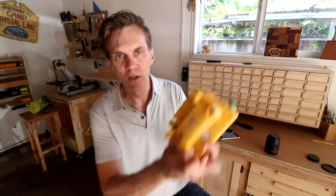I have some more homework for Antonio. Looking at the tools you showed me, here are a few you'll want to consider getting: first, if we want to do a curved cut, you're going to need a jigsaw. I highly recommend getting a random orbit sander. You'll need a couple of clamps because we're most likely not using any fasteners — it's all going to be glued together. I'd suggest bar clamps or F-clamps. You'll also need safety equipment: I use an N99 mask that filters out sawdust, hearing protection, and safety glasses — don't work on any tools without those. When using your table saw, you'll need a push stick so your fingers aren't close to the blade. I use the Microjig Gripper and never make a cut without one.